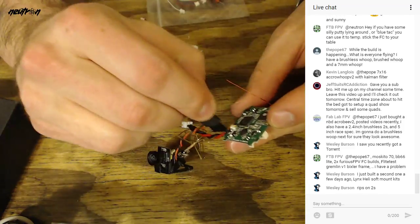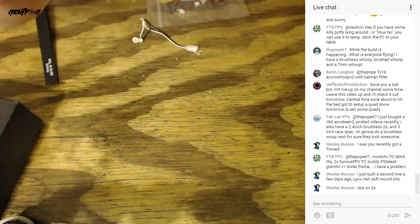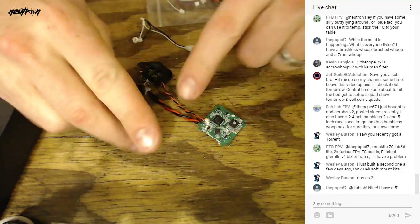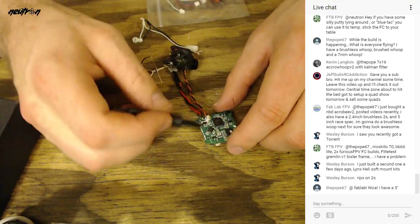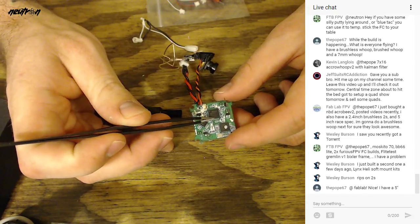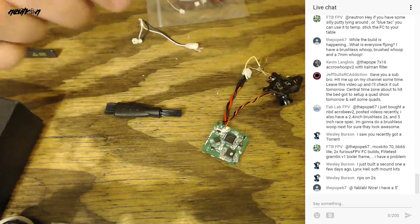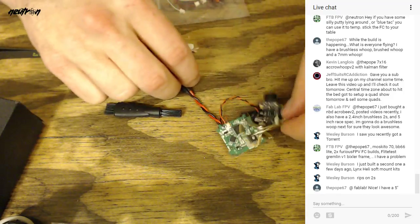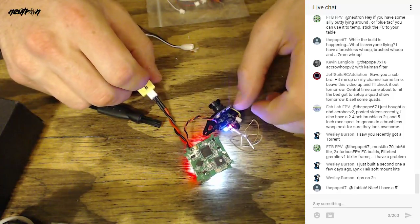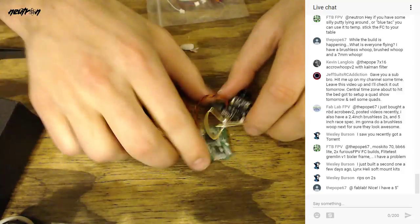Just to be safe, I do like to brush them up a little bit. And always pay attention. Be careful of splatter, because you'll see little smoke trails come off your solder as you're soldering something. If those little balls get stuck and bridge one of these tiny little pieces, or get stuck somewhere, that could be bad news. So again, I don't have a multimeter, so let's do the old smoke test, plug in a battery. Boom, sausage. Board is good, camera's getting power, ready to rock. So that's good to go.